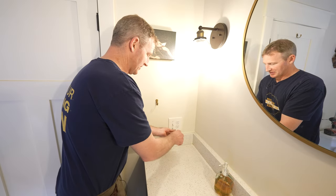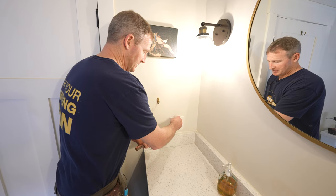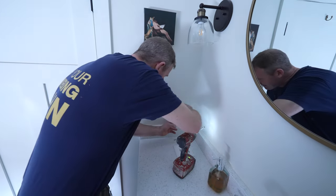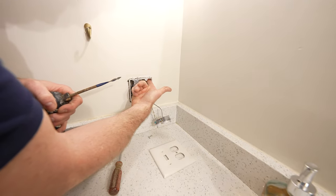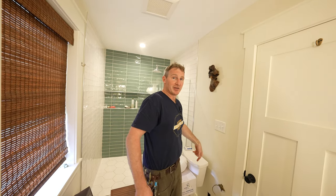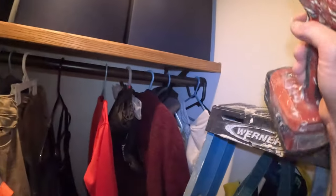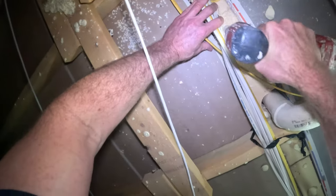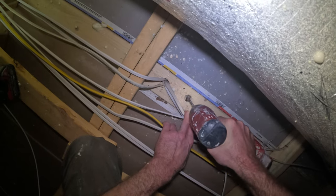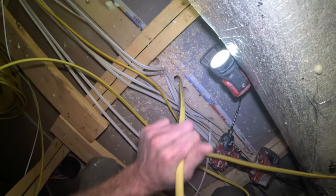This switch is actually just this lighting here, but that's not going to interfere with anything — we're just going to run it off of this outlet. What I normally do is cut a little hole in the top of the box and run a fish stick up through here. The game plan is to drill through the top header and then fish the wire down into our hole. This is definitely the part that can vary wildly from one home to another. In this particular situation, thankfully, I don't have any insulation at the ceiling level — I'm able to see all of my wires. I basically just found all the wires going down to the switch boxes and drilled through that top header plate. Easier said than done, but in this one it actually was that simple.